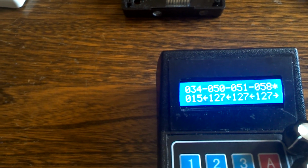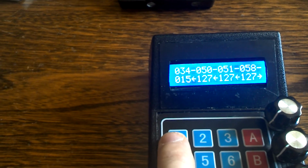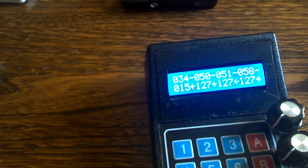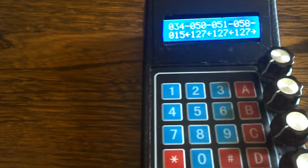they're going. And if you go to the keypad here, you'll be able to turn this function on. So let's say this first guy, I'll press. You see next to 34, it went to a dash. So that's telling you the function 0 is off. The second locomotive, I'll change the function 0 off. Third, I'll change the function 0 off. And fourth. That's it. So what's happening, instead of using this button as the speed up and speed down of the first locomotive, I'm using that first pot, and same as you continue. The second train, second pot, third train, third pot, fourth train.